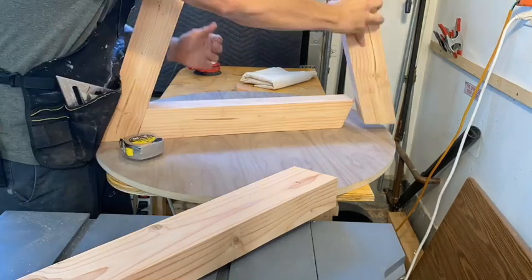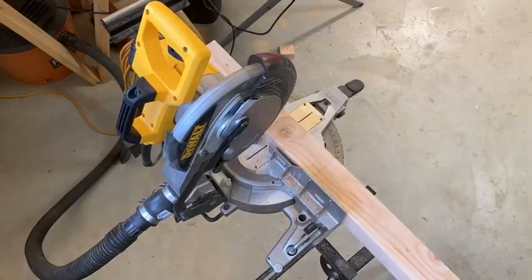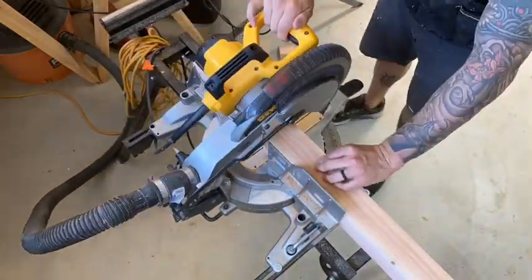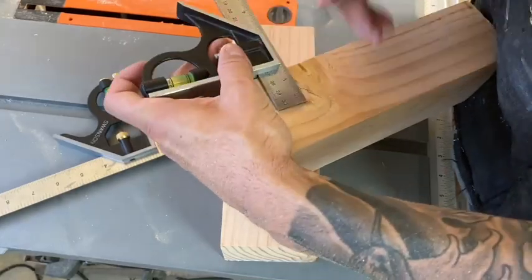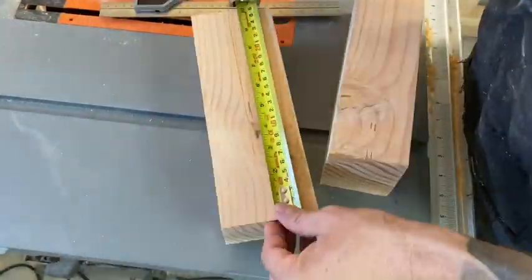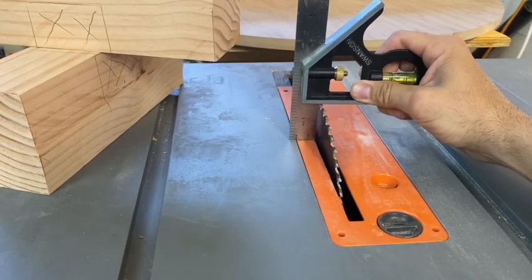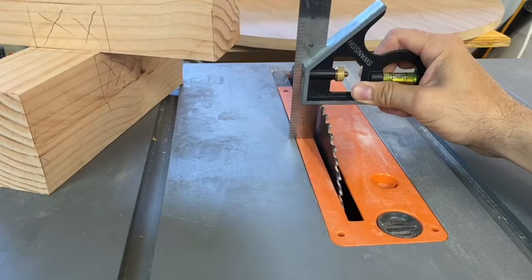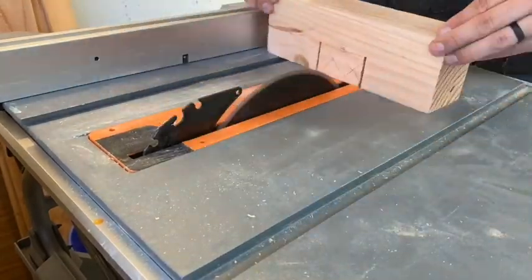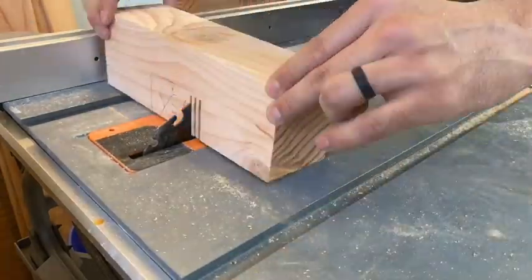I then do a bunch of complicated geometry just off screen and cut the floor pieces to size. But these floor pieces ended up being exactly 10 inches. The legs were exactly 2 feet, giving the table a 32-inch diameter and a 22-inch height. But no worries, I'll leave all that in the description below.